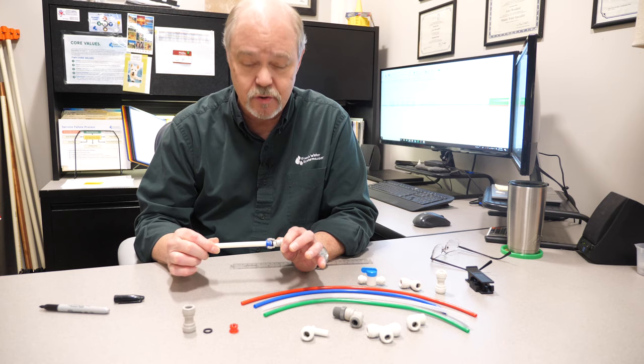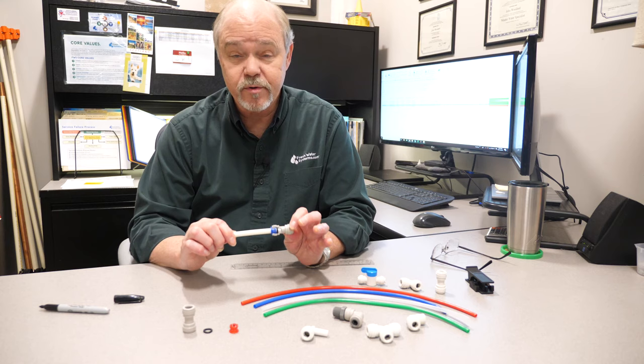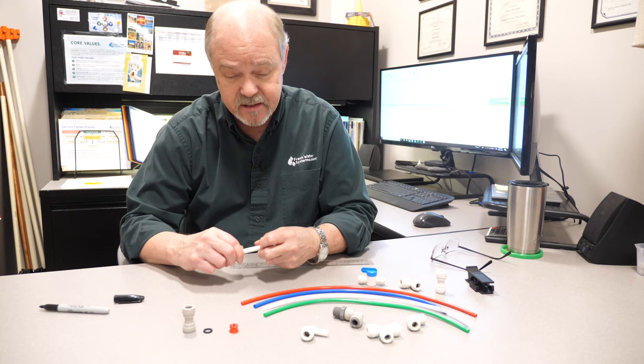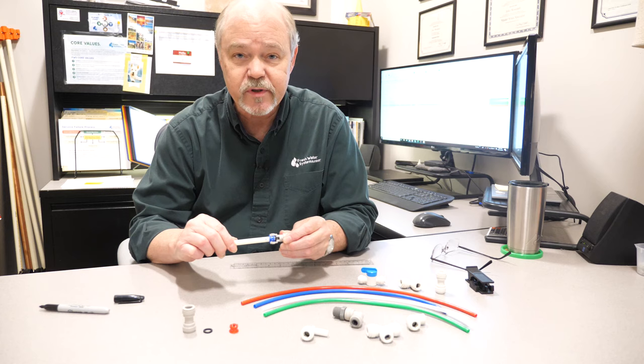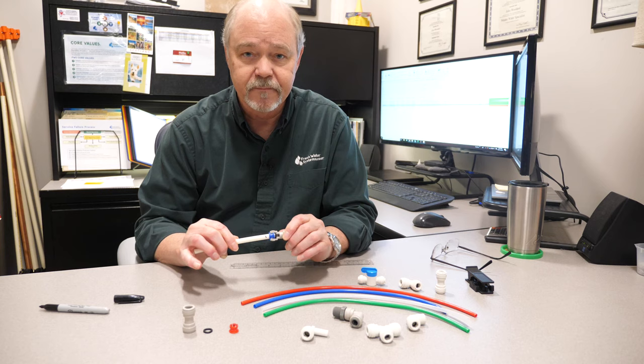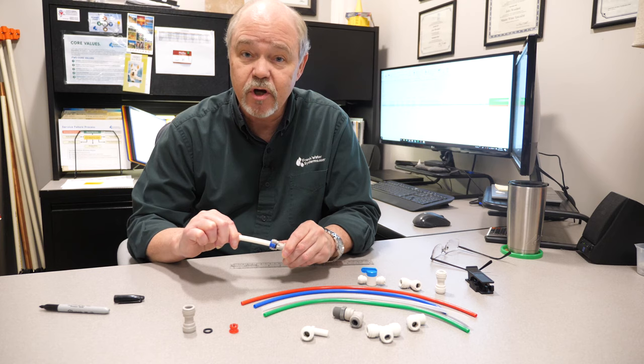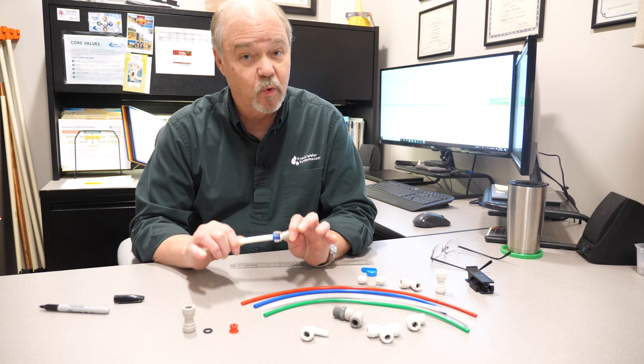That's a great way to know that you got the tubing all the way through the collet and all the way through the o-ring. The importance of this is that the o-ring is what creates the seal — if the tubing doesn't get pushed all the way through, it's going to leak. When the tubing hits the collet there's some resistance, and I think that's where people think they've got it all the way in. Another tip: wet the tubing a little bit, because that moisture will help slide it through the o-ring and all the way into the base of the fitting.